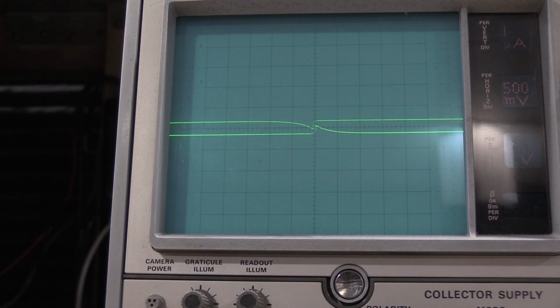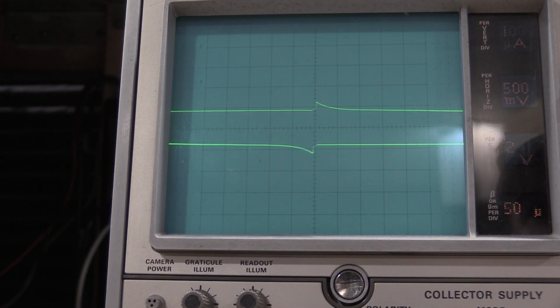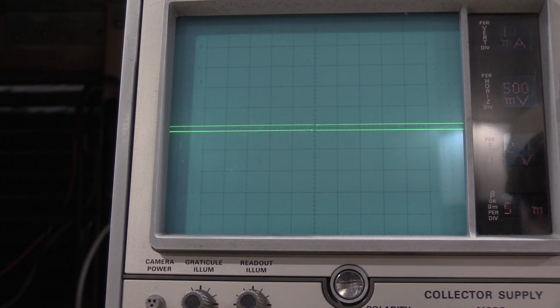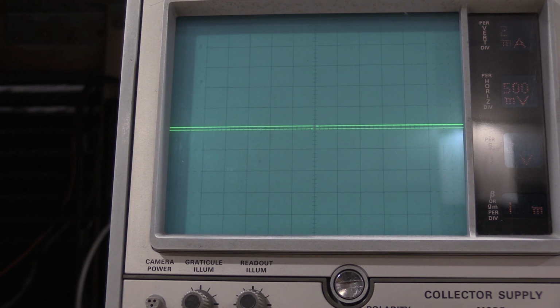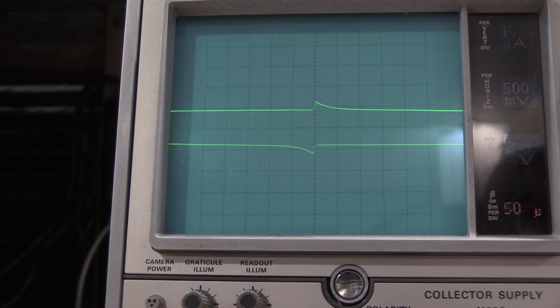So right about there. It does say in the manual that the step gen may be inverted, but that's the R8 adjustment. And it wanted there's the other version. But see at 2, I can barely see anything, which is where the manual wants me to adjust it. So I'm moving these 2 bright spots right there. So I'll zoom out so you guys can see it. There we go. 0 cross. Okay, that looks like the manual. Kind of. The picture's really bad.